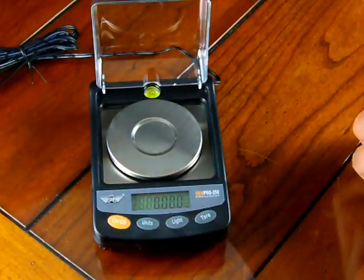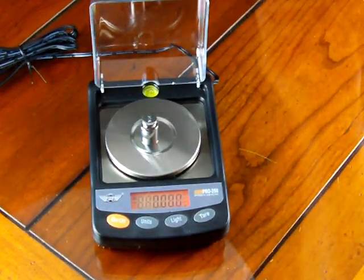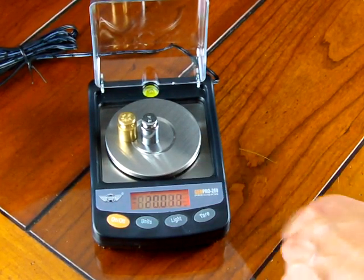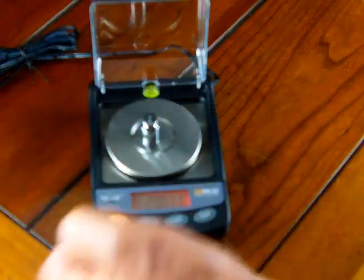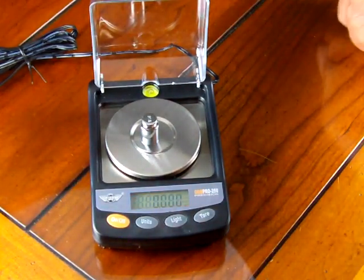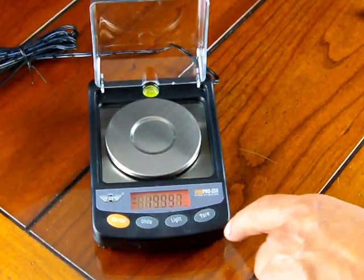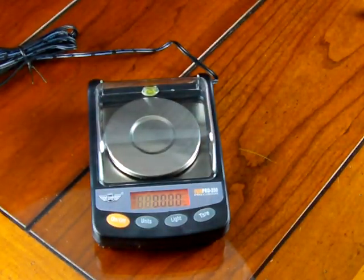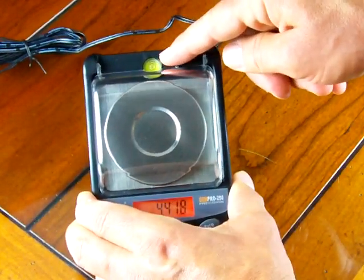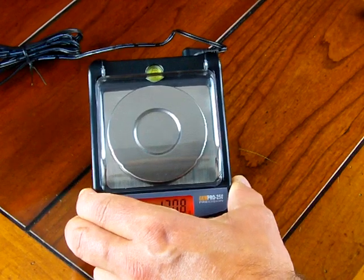With the tare key — if I have 20 grams, place it on the scale, I could tare it out. Place another 20 grams and tare it out. The cumulative total can never exceed the weighing capacity, so you have to be careful. There's no fill guide or indicator on the side of the display, and you do not want to ruin your scale by putting an excessive load on it. The scale also has a spirit bubble in the rear so you can level it — critical when dealing with a milligram scale on a steady surface.